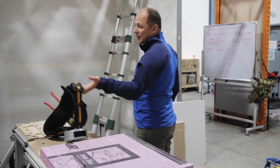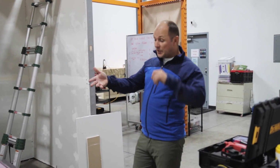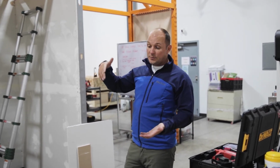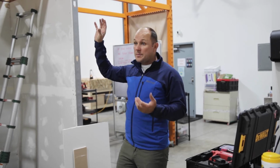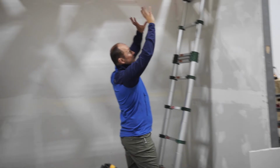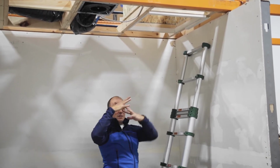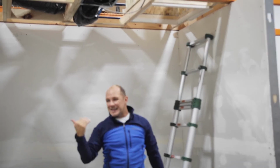Just because they like it like that? Just because they've had 30 years of people not doing it or doing it poorly, and then the first time they go up, they can't ever get back down. Just think about it. If you have your plywood and your hatch in your hand, and you go down and it catches, like it did with me 2 or 3 times, and now all that's up there like a deck of cards. It's not insulating anything.